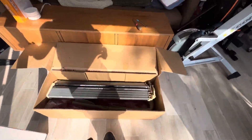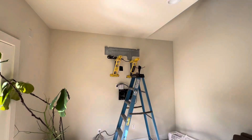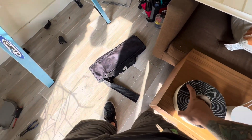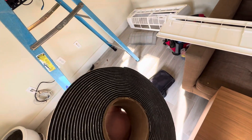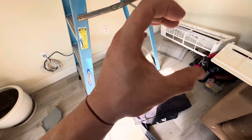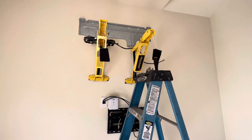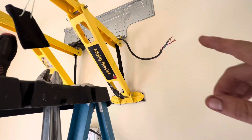So I slapped the new one in, screwed everything down, and I'm going to clean up that insulation. I brought some insulation tape right here — this is what I like to use because I can wrap it tighter and it works. Sticks real good at the end. You just put some electrical tape wrapped around it so it doesn't come off, or just put a zip tie and it works. When you use this insulation tape, since it's not that thick, all the copper behind the evaporator coil will fit a little bit more comfortably and you'll be able to snap it on the wall a little bit easier.